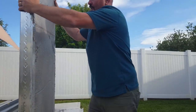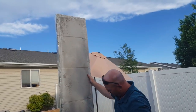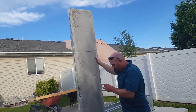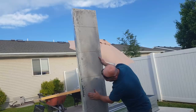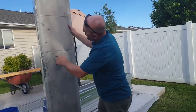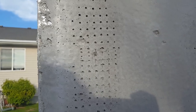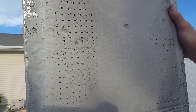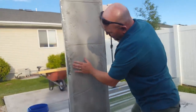It's really moist. It looks like when we're doing the rest of them, we need to tamp the bottom and tamp the wire fabric that's in it. If you come get a close-up right here, at every cross of the wires there's a little hole. There are a few over here — you can see them kind of all the way down. But then there are other areas where it got in really good. All we need to do is just tamp it.